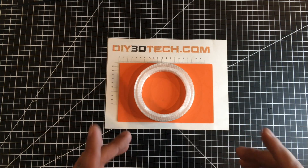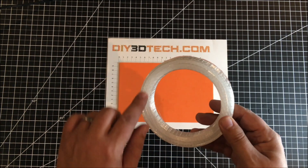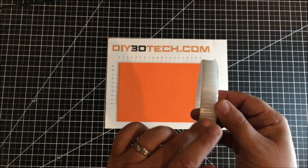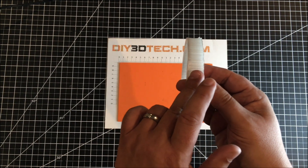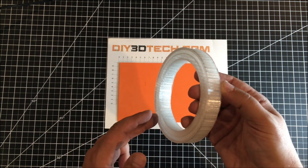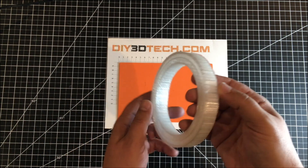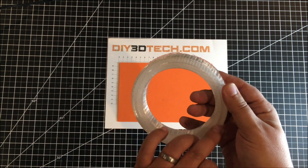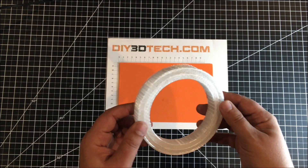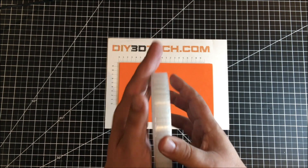I didn't just create a flat gasket — I did this with a little bit of intention in mind. You'll notice there's a rim in here for the light fixture to set into. With the top of the light fixture like this, if there is any type of water or whatever, the housing or mounting for it will be recessed in, so it'll roll over like flashing and onto the light fixture and down. This inside seal is meant to be a bit tighter and create an inside seal too — basically belt and suspenders when it comes to seals. And it's just flat on the back to go against the back of the housing.